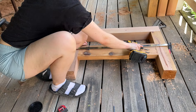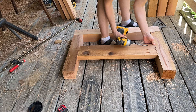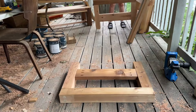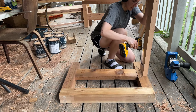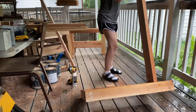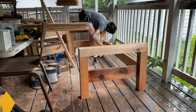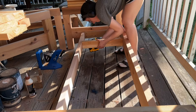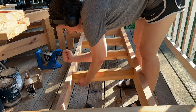On the legs there was a bottom span to add in. Clamps are really your best friend especially if you're doing a project alone, so invest in clamps. Most of the rest of this project is pocket hole construction, so if you have a pocket hole jig this will be really simple. Once I got the legs built it was time to attach the sofa part together. A storm had to roll in — not technically summer yet but that's how Texas summers go: random heavy rain, then sunny and beautiful again just in time for me to add all the slats.